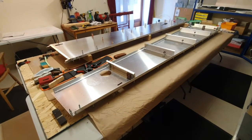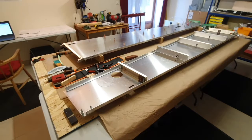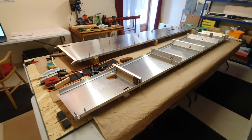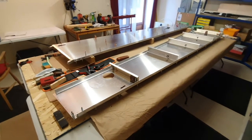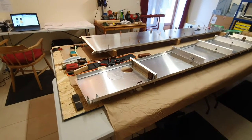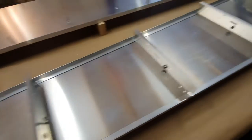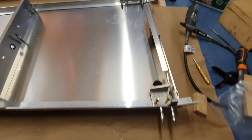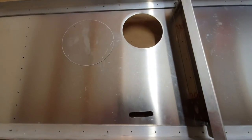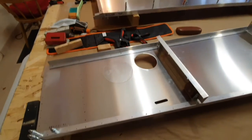I'm making good progress — I've spent a few days over Christmas, between Christmas and New Year, an odd hour here and there as I can, in between the festivities and contacting all the relatives. So far I've cut the second set of holes in the left-hand side panel: a hole there, an inspection hatch, and the hole where the rudder cables go through. I've cut all the longerons — both sets are done — and they're all drilled and pilot drilled onto the panels.